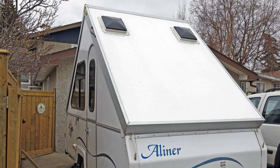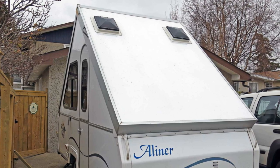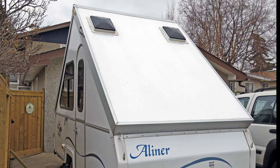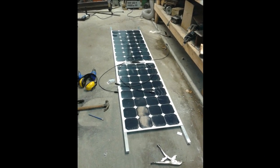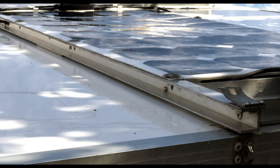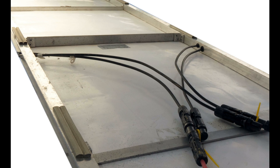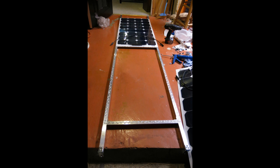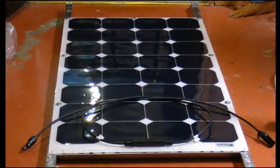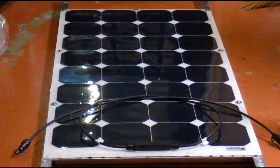Although it is possible to just glue the panels to the roof, I rejected this option as I wanted something that was easily removable. So I built an aluminum frame using one-inch square U-channel extrusion. This provided rigid support and airspace between the panels and the roof. The U-channel made it easy to fabricate the frame with aluminum rivets. Once the basic frame was constructed, I glued the solar panels in place and secured them with sheet metal screws and washers.